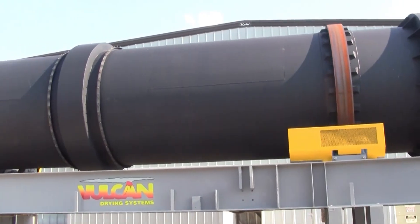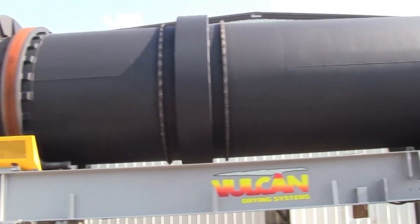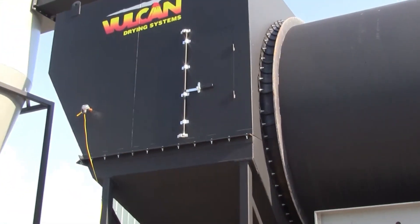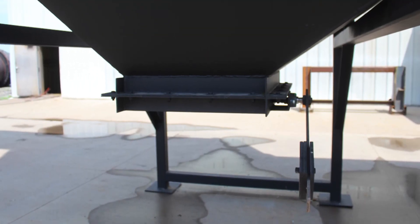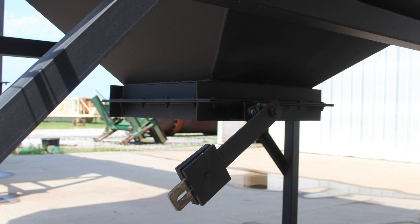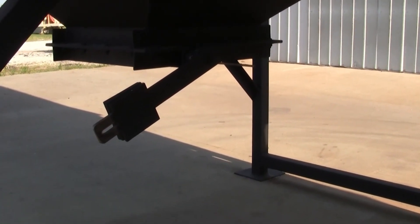The dryer is turned by three-phase electric motors. As the product dries, it goes down the dryer to a discharge knockout box. Discharge from the knockout box is through a counterweighted gravity-operated flap gate, which discharges onto a bagging system or conveying to further processing.